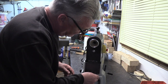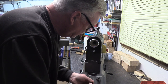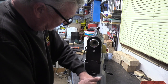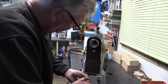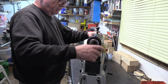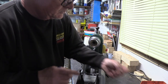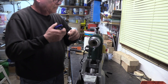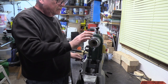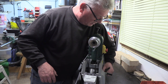Great little tiny things these are. I still think it's easier to remove these three bottom screws than it is the screws with the nuts and washers on. So that's nearly all ready to run, but what I will do is actually put that little grub screw in — just make sure the screw goes below the surface of the poly V-belt pulley.